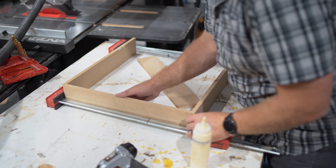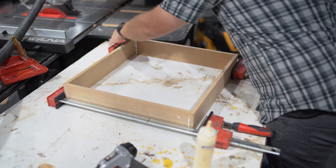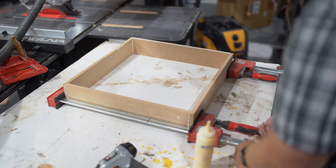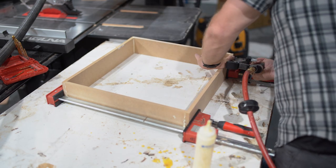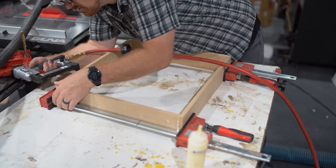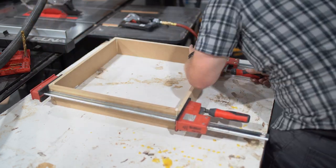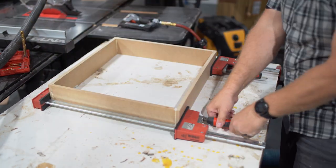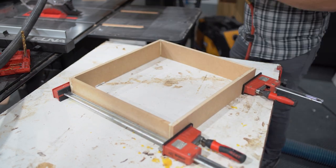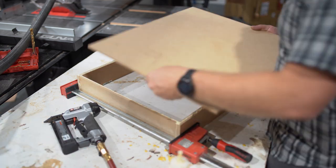With the cabinet now installed on the wall, I assembled the drawer. This is literally the weakest drawer assembly you could possibly build, and I'm going to load this thing down with 20 pounds of nails and air tool components and I'm not even a little worried about it. I clamped together half-inch MDF with pin nails to keep the pieces aligned while the glue dried, then reinforced this even more by gluing and pinning on the bottom panel. For shop furniture that will hold less than 50 pounds, it's usually more than adequate — the glue typically dries stronger than the material itself anyway.